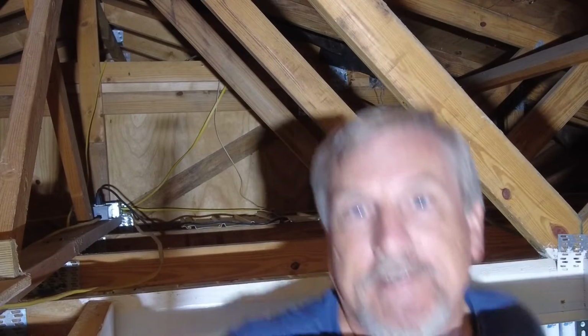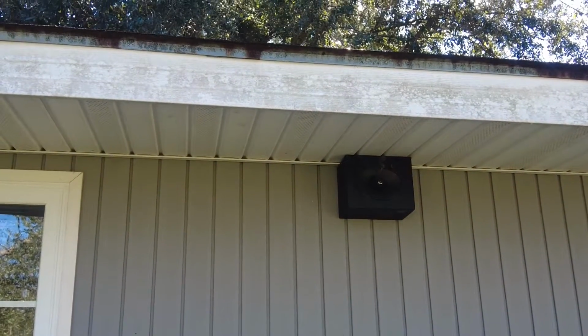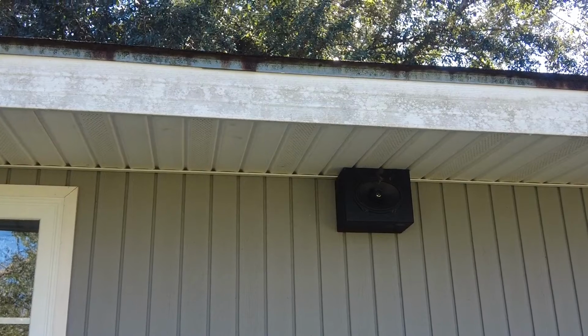All right, change of plan. We need to get the outside done before we do the inside. And that's the eave, and I'm going to install some eave exhaust vents. If I hook the dryer and the shower up separate, that'll ensure that they both exhaust outside instead of the dryer exhausting back into the bathroom, which would just make it terribly humid, which would be another problem I'd have to fix. So let's do that. Let's hook up 2 exhaust vents from the outside going in.